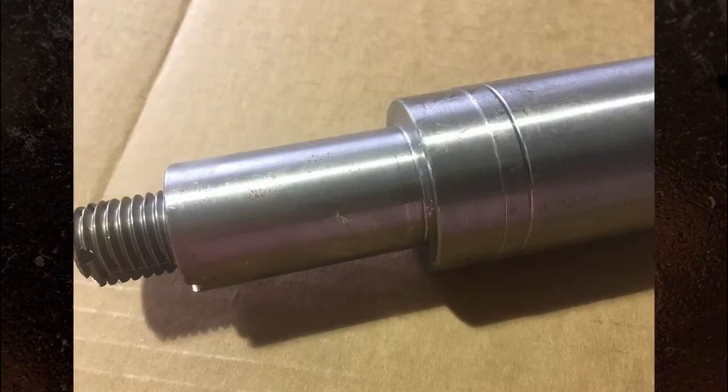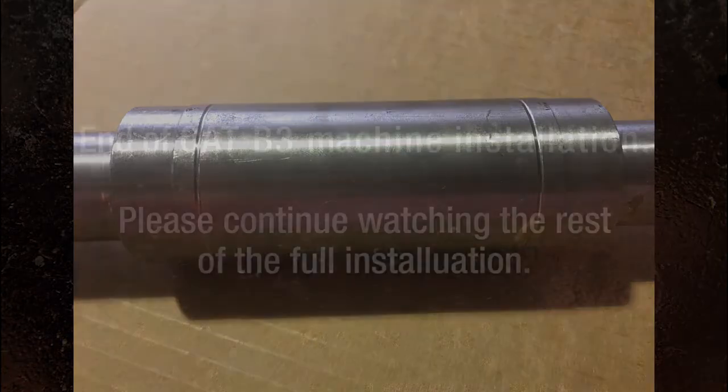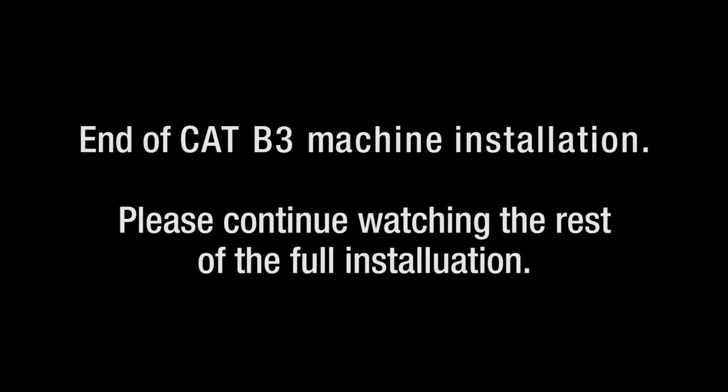On the narrow frames, you will see alignment grooves cut into the Bair axle shaft. These grooves will protrude farther out from the frame than shown in the video for the older style frames. Use the grooves on the shaft for centering the axle on the frame. Equal measurements on both sides. Continue to follow the rest of the video for installation.